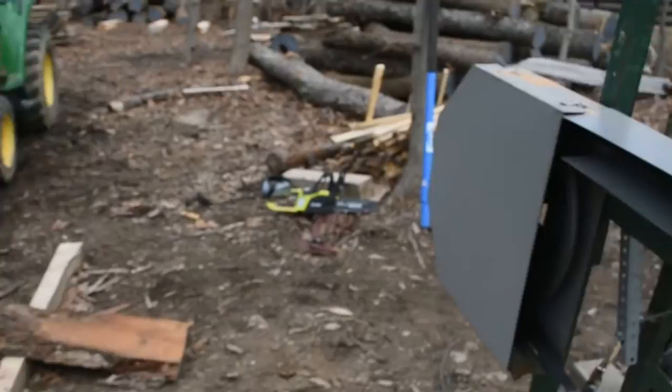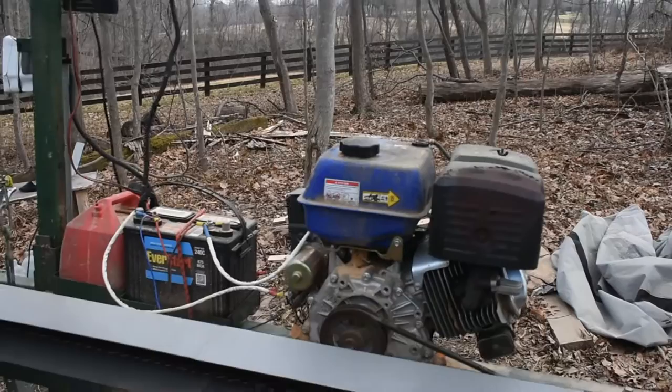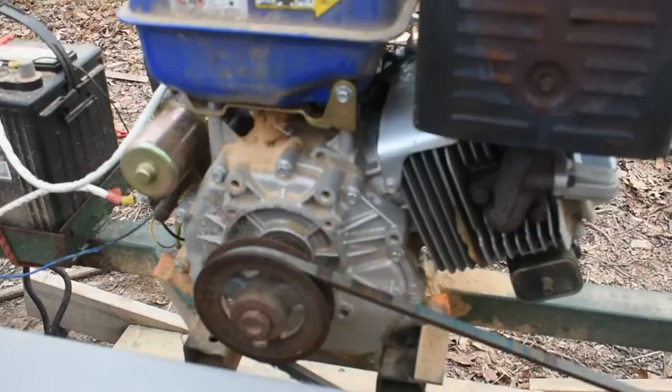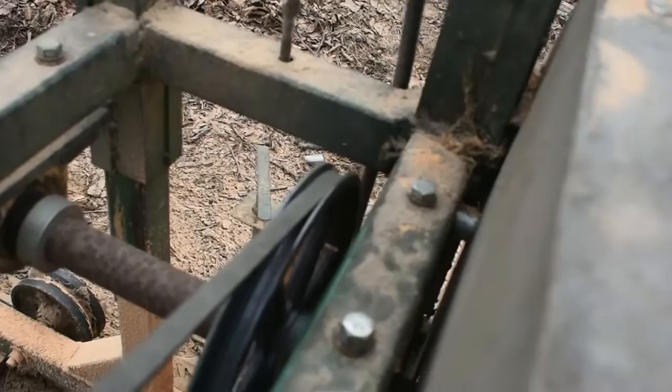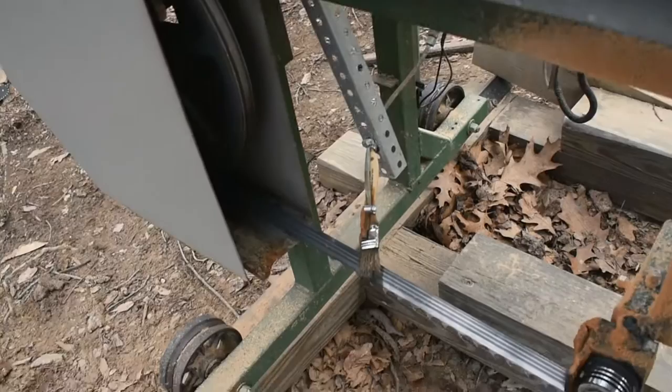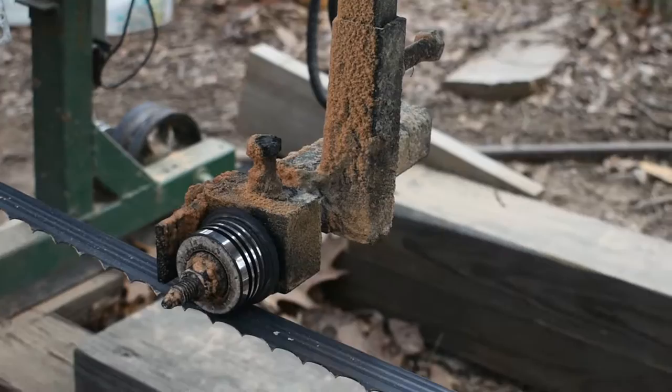Getting the carriage going up and down is fairly cheap and easy. The next part is the powertrain. I have an 18-horse Duro Max gas motor here. This pulley is driving a drive axle, which sits on pillow block bearings. That axle carries the blade around — when this spins, the wheels start going and the blade is cutting. That's how it gets power. The engine drives this side; the other side is just an idler with no direct power.